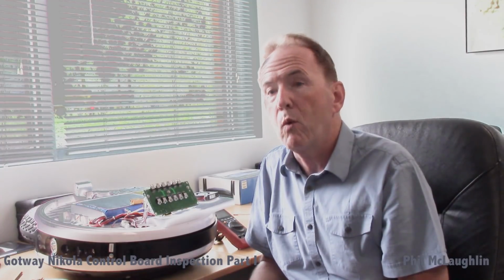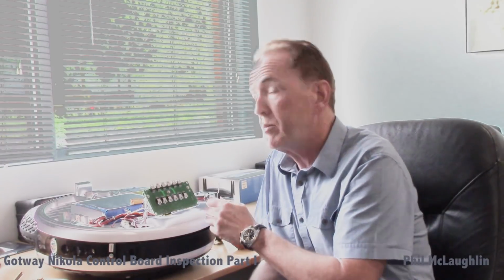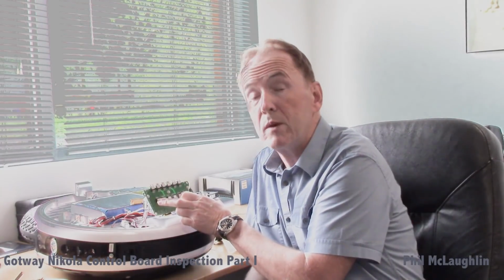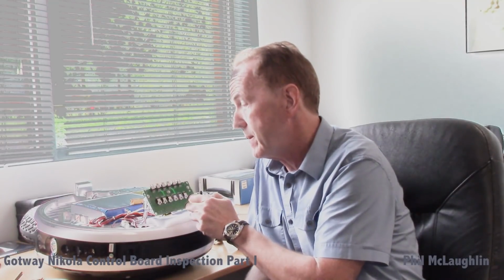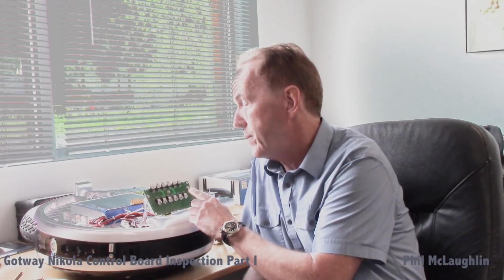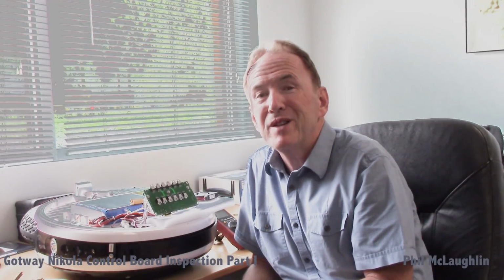The question would come up, what am I going to do about these heat pads on there? I mean, obviously the options are putting a pad solution similar to what we've seen already with those heat pads on the side. I think it would be rather difficult to assemble that without some type of a jig, but I think I would know how to do that anyway. And then there are certain other commercially available products we can use to do a good thermal coupling from these MOSFETs into the board.